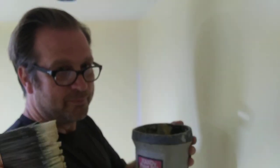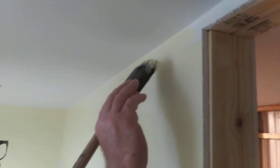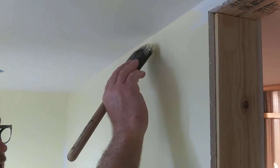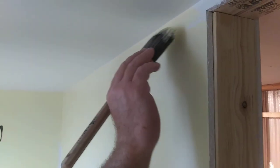And you have a perfect line, no taping. To review: start with the right equipment, then get the right amount of paint on it, put it on at the right angle, make sure you knock off that extra little bit, and drag just the right amount across the edge.